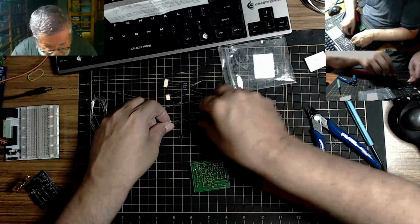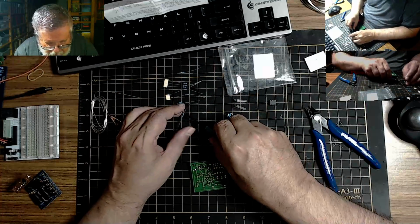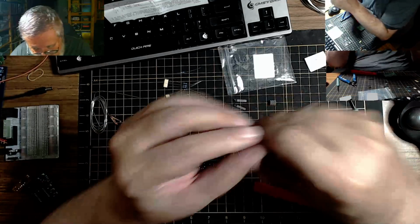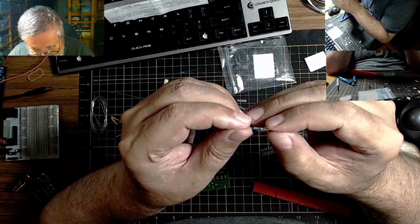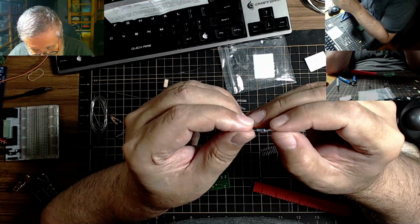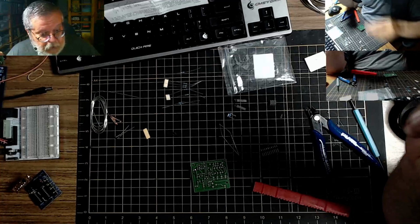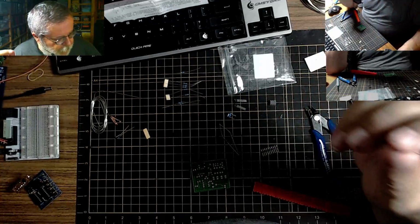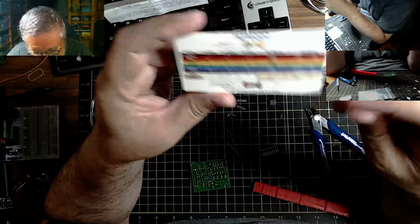So our first resistors of the day. Couldn't pick them up off the mat. So our first one's here. 5 band, brown at both ends. So it's either brown, red, black, black, brown, or brown, black, black, red, brown. So which one are you? This is where the other card comes in handy. This one from Smaza, so that we can deal with 5 color resistors.